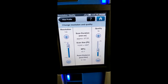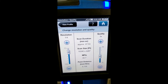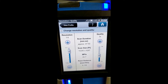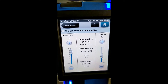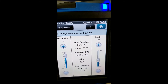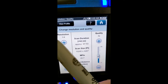Because the scanner is firing out laser points that are spreading away from the scanner continuously, the best way to handle long distances is just to increase the number of points being emitted from the scanner head. That's what the difference is between long and short scan ranges — the number of points that we are firing. An outdoor scan setting at a quarter resolution is about 44 million points.